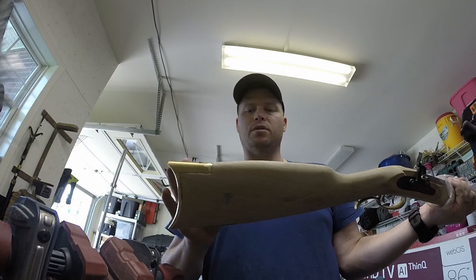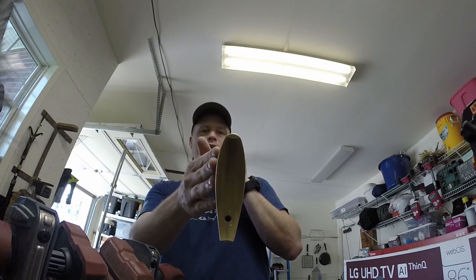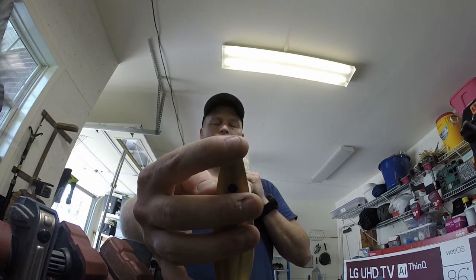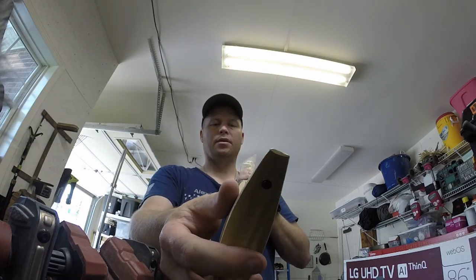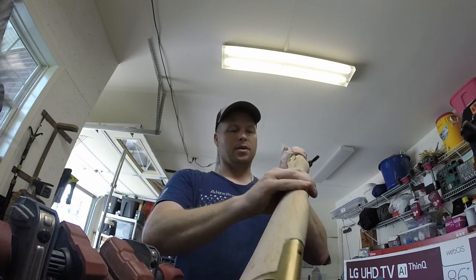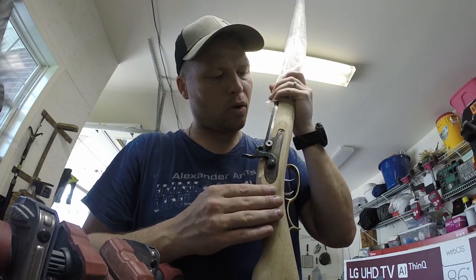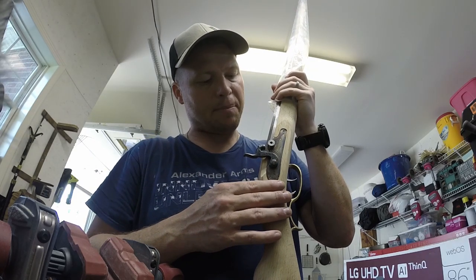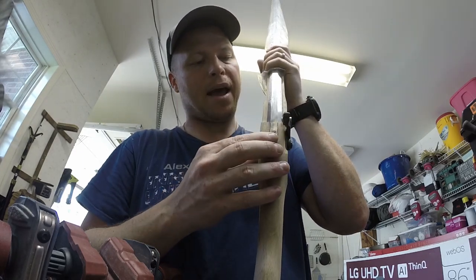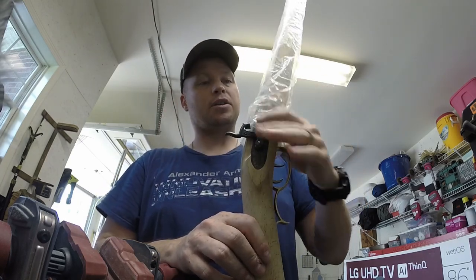It's actually good looking down the side so far. The back end's looking good on both sides. I've rasped it initially and then took a file and filed off this metal - none of it's polished at this point. I've flattened out the bottom side of the butt plate and toe plate. I also did the underside here, which is very flush and nice fitting, to include this lock. Not a whole lot of work was done in here - I'll finish that mostly with sandpaper since it's already pretty close. I'll remove this lock and finish that out in the sanding portion and barrel the tang that comes down in the back end. This week is finished up - stay tuned for next week, be safe and we'll see you next time.